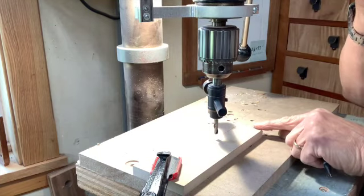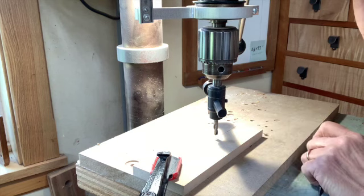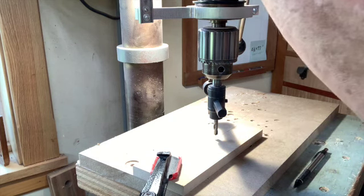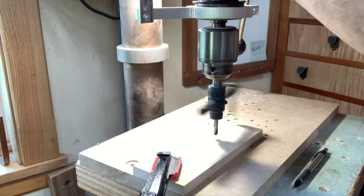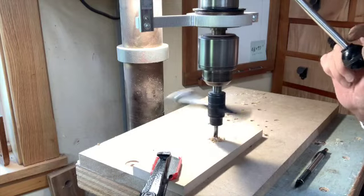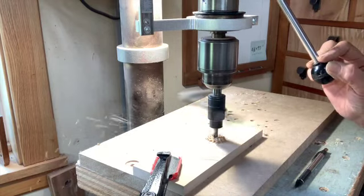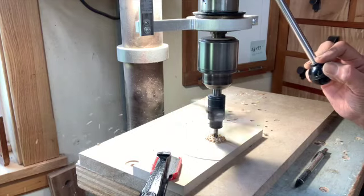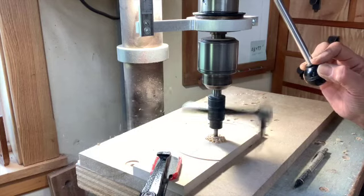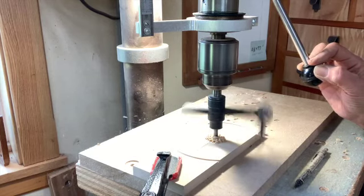I also checked to make sure the cutter and beam of this thing does not hit that clamp — that would certainly be bad news. I have my dimension set up, I'm clamped down, and my drill press table is tightened. I only need to make this cutter drop down about 60 thousandths of an inch because that's the thickness of my inlay material. I'm going to demonstrate this quickly and then move the cutter out and make a second cut after.